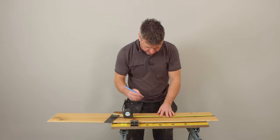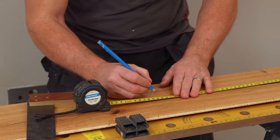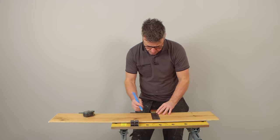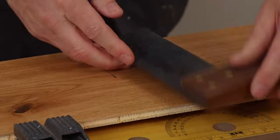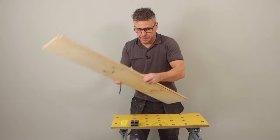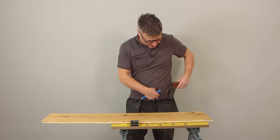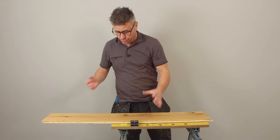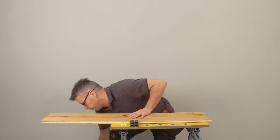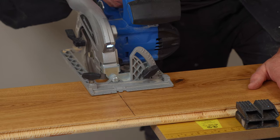So 434 — little mark there. Double-checking with my glasses on. I'll square that off with a set square. Now I'm going to cut this down — there are a number of ways you can cut this. Of course you can cut it with a hand saw, a chop saw will also be great, or even just a small cordless circular saw like this, which is quick and easy.